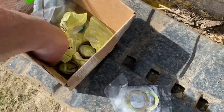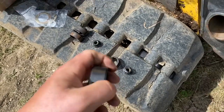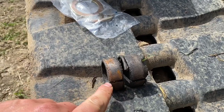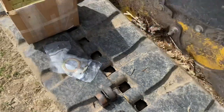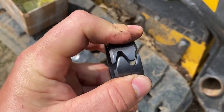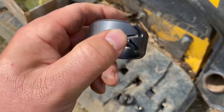Something they did change is that it is no longer just a straight split. With the straight split, there's a part of the pin that is not supported — there would be a slit right where the pin is not supported, so there's a possibility it could wear along that open edge. It was smarter of them to put a wave or kind of a claw in there to ensure that the pin was supported all the way across. That's an improvement.